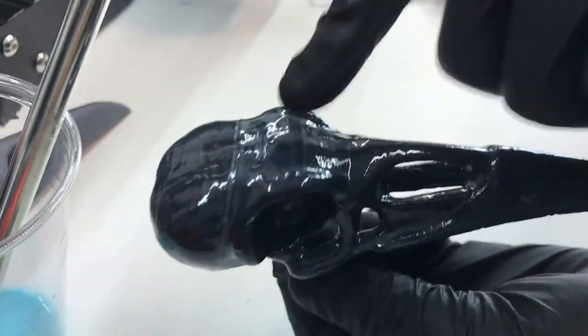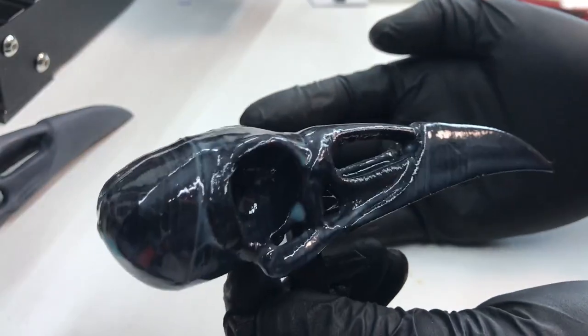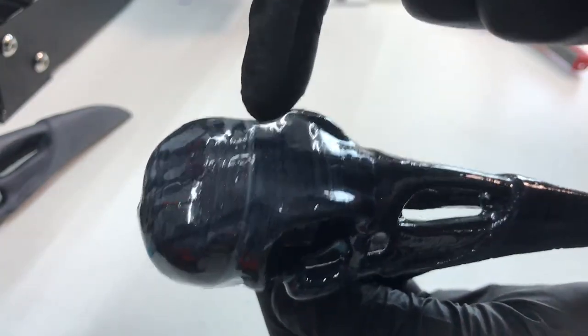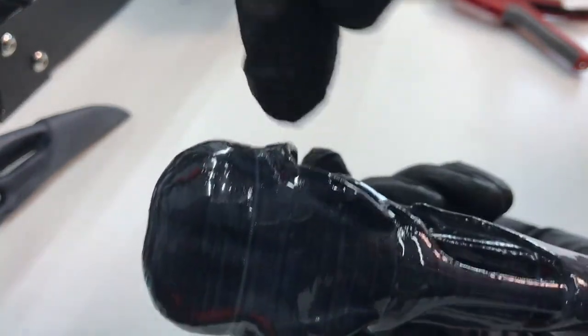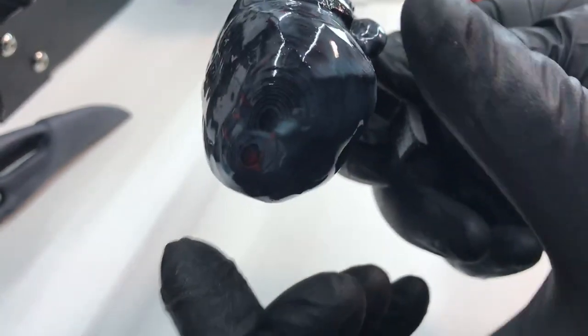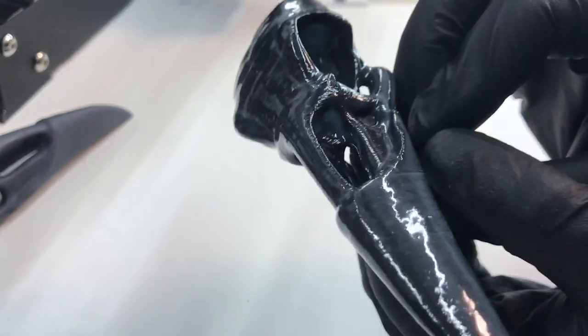Check this out — it's cured. It's been in the UV curing station for about two minutes and it's pretty good. You can see because of the blue resin on black, you can see where it pools more. Look at that seam where the two halves were joined — you can see it filled it quite nicely. My trick did work: I held it so the UV light came in from this direction and it cured it. One side effect is there's a little blob of resin on the bottom where it pooled. Not a big deal — you can sand it.